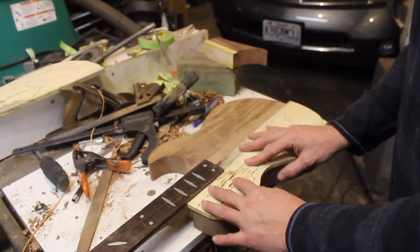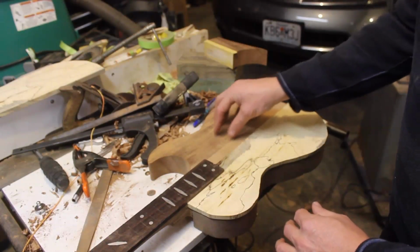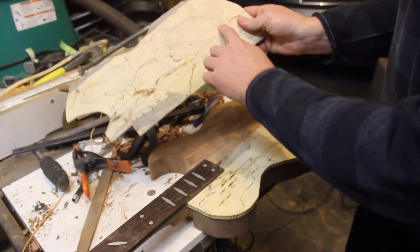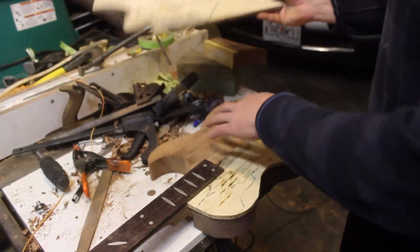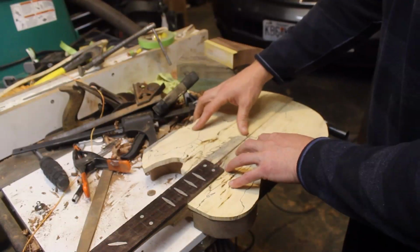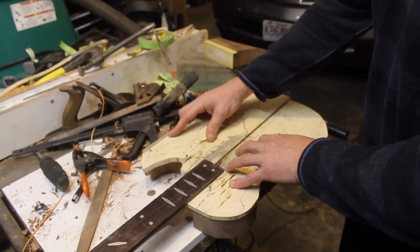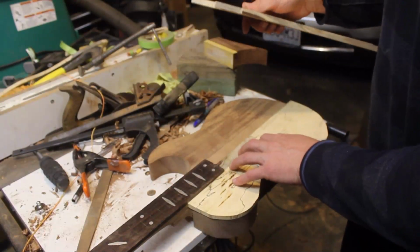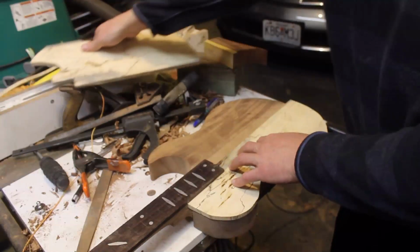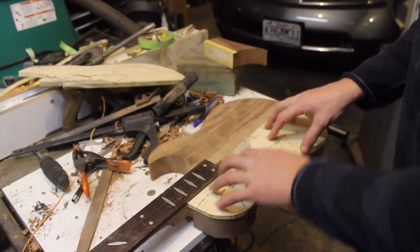It's still gonna look sweet as hell. But I think I'm gonna glue and clamp this in place before I get all the routes made over here. And the reason is, I'm going to have to coordinate routes in this piece and in this piece. And if I'm able to make holes in this and then stick it in the same place every time, locate it using this, I think I'll be better off. So I may regret this decision, but I think I'm going to glue this piece down so I have a benchmark to go from.